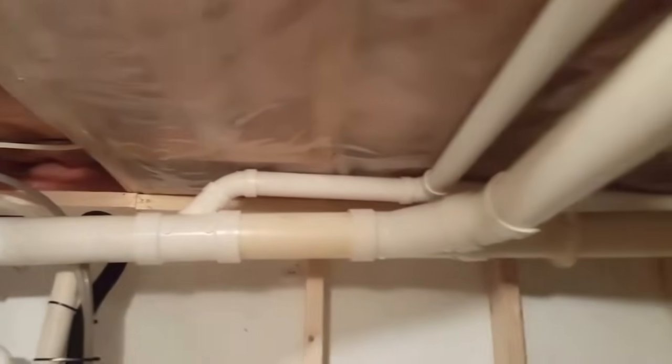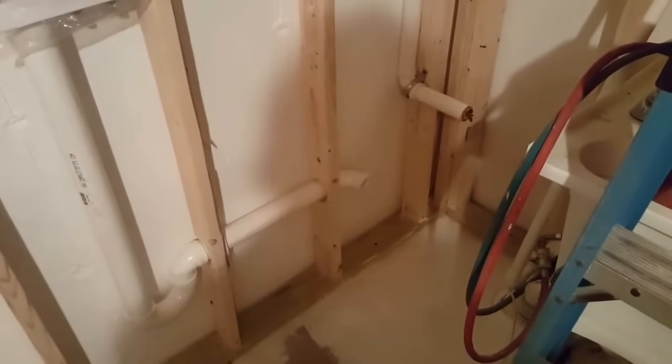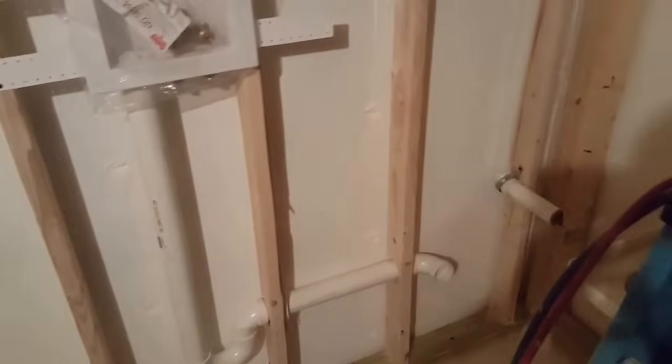It essentially just creates a big air loop. And that line is going to come over to my main. And it's going to tap into my main at the top right there, where it's not going to take in any water. In my setup, I also have it picking up another vent line for a SaniVite or a SaniCom, which will be installed just as a corner sink over here. Most likely going to be the SaniCom because that can take a direct connection from my wash machine. So again, that is an example of the wet vent. It taps into the main at the top, and it's perfectly legal in this area. Just check your local code if you can use wet venting.